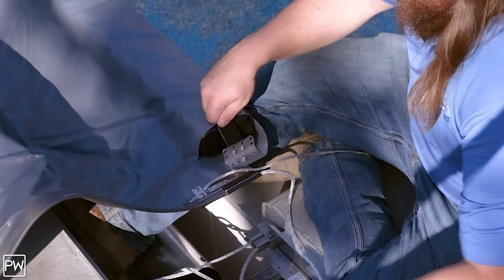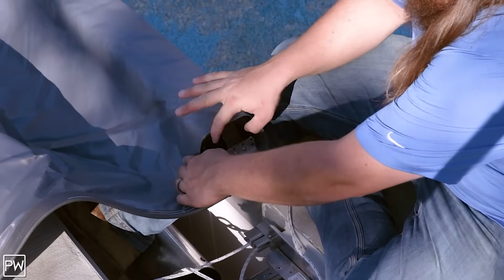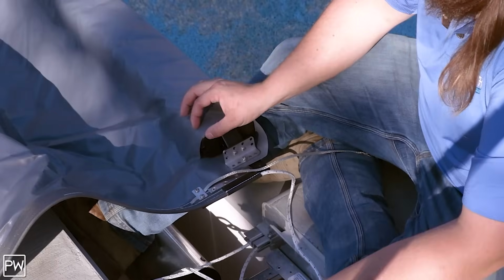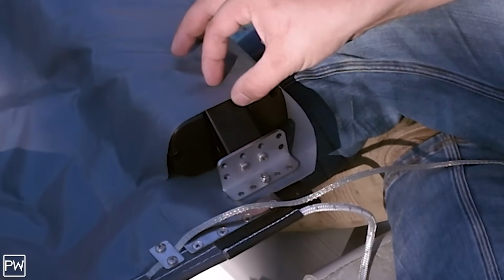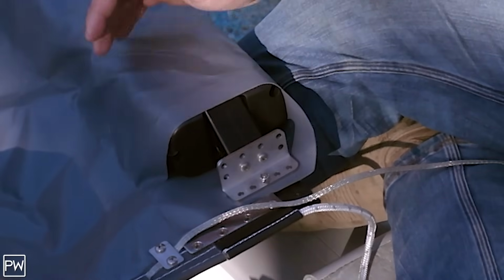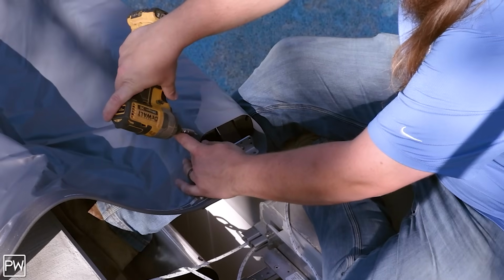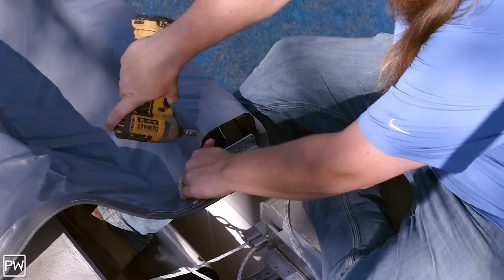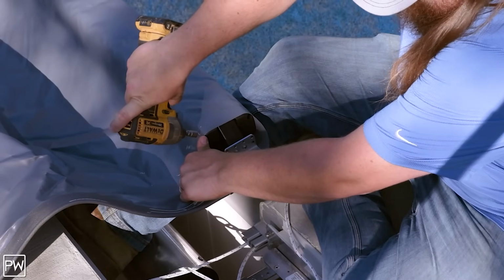Now here, we are gonna make sure the edge of the fabric is flush with the plastic cap. The plastic cap is pushed all the way into our leading edge bar. We can see if we look very closely, we have about a 3/4 inch wide strip of fabric that has a different texture to it from the heat weld. We're gonna go right into the middle of that heat weld at a 45-degree angle on the round of our leading edge bar. Just like this, slowly.